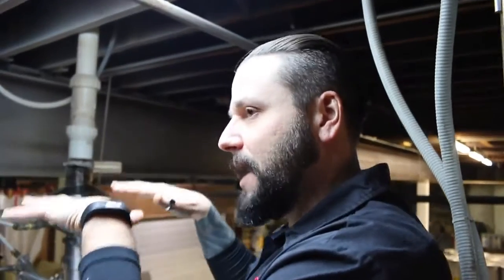The unique aspect of barley is that when you crush it, it has the husk, and that husk will create a natural filter bed. So after you let it rest, we do what we call a Vorlauf, which is to recirculate the wort, which is what we call this liquid. It's not beer yet, it's called wort. You recirculate it until you get a nice clear wort, and what that means is that you've got a natural filter bed, which is filtering off the things that you don't want over here in your kettle. Exactly. So we run that, and then once that's good, we start our sparge, and we basically are just rinsing the grains as the wort's transferring into the kettle. Taking it over.